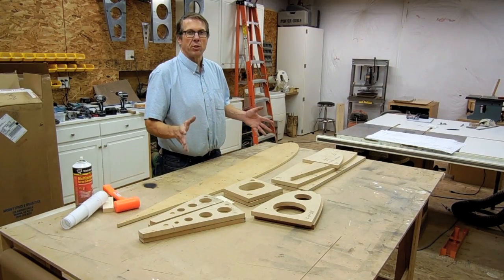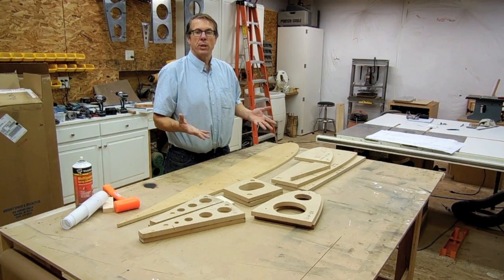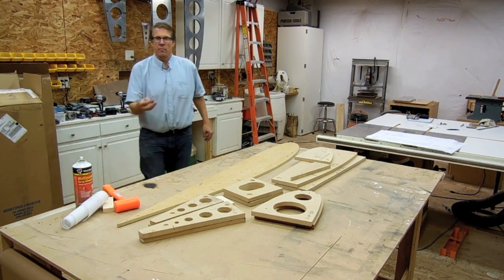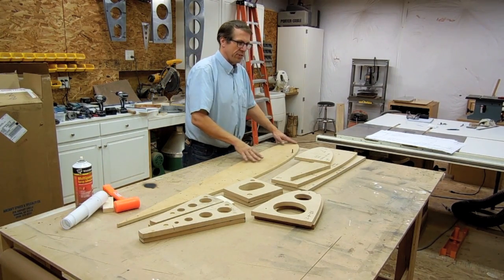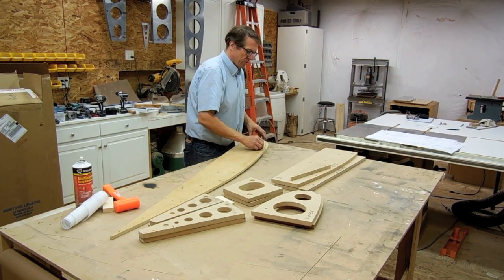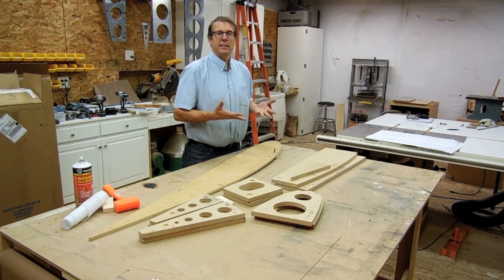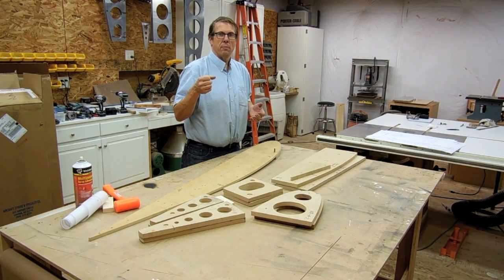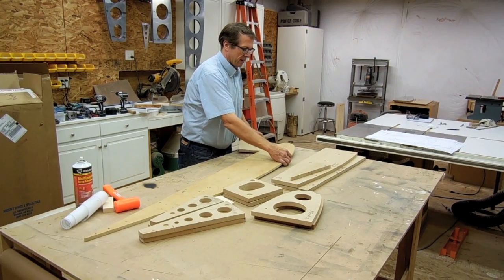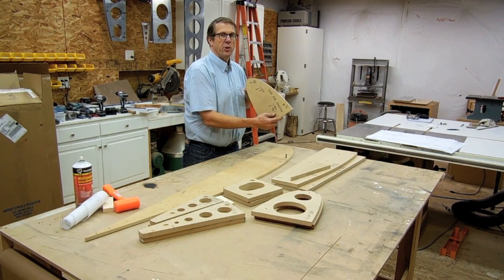With the nose rib, what I did is I took this piece and put it on top of a piece of three-quarter-inch MDF. I drilled through the jig pin holes and used some quarter-inch dowel pins. I would use these to put this through the piece of MDF. I basically rough cut a piece of MDF so it was an eighth-inch to a quarter-inch larger than this size. I would attach it with jig pins and take it to my router using a template bit — basically a flush-cutting bit with a pilot bearing on the top — so it followed the outside edge of this master jig. I was then able to get an exact copy of this master jig onto my master nose rib jig.